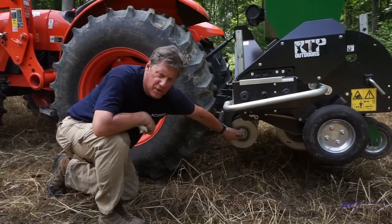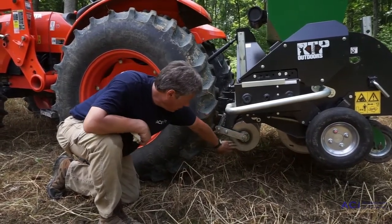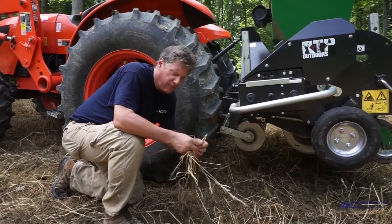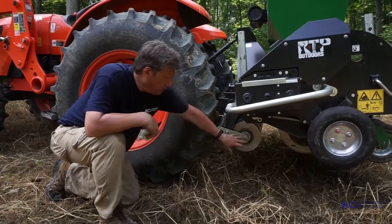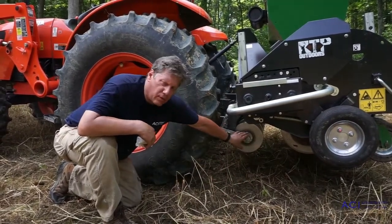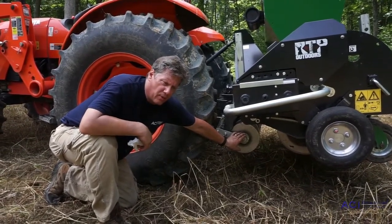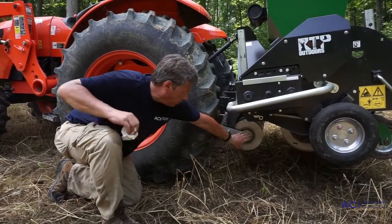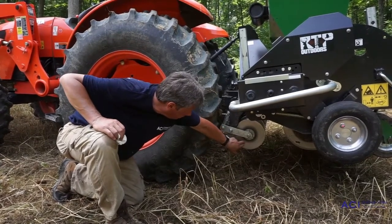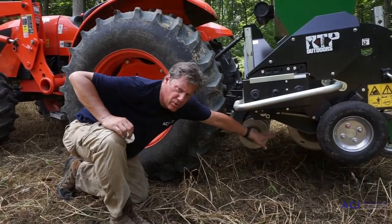Before we get started planting, we want to point out that this Genesis 5 is equipped with optional fixed knife cutters. These are designed to chop through vegetation, fodder, and things left on the ground. In the particular field we're in, we have a little bit of residue but fairly open ground, so the disc cutter is not really required here. We're going to some fields later today that have a lot more vegetation where this will be required. What we don't want is to run too deep — we just want to cut through the vegetation and let the planting coulters do their job.